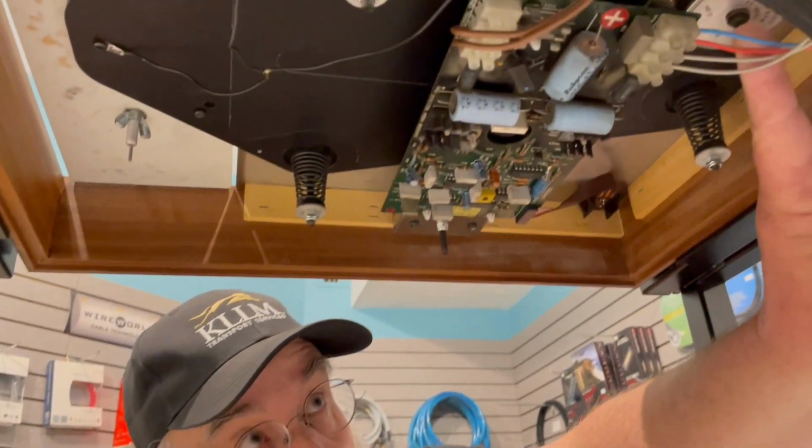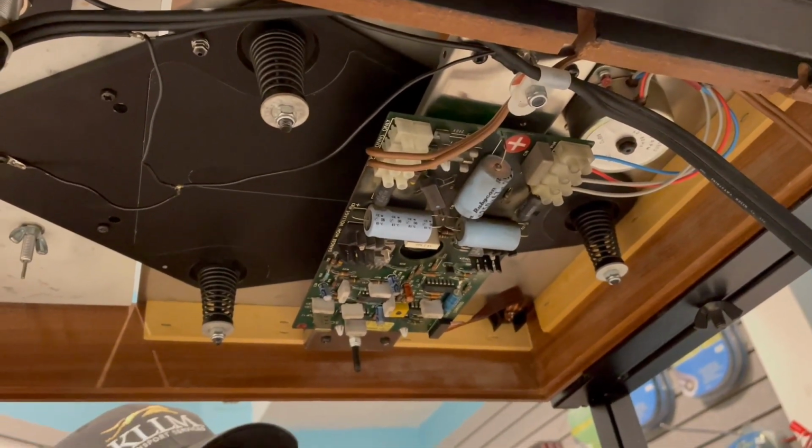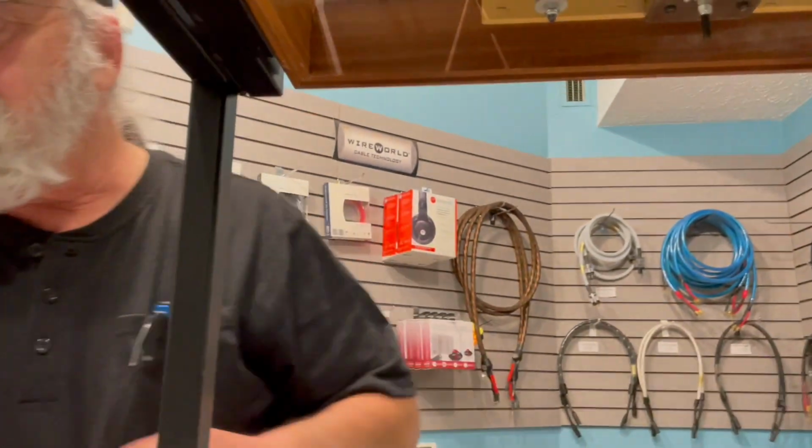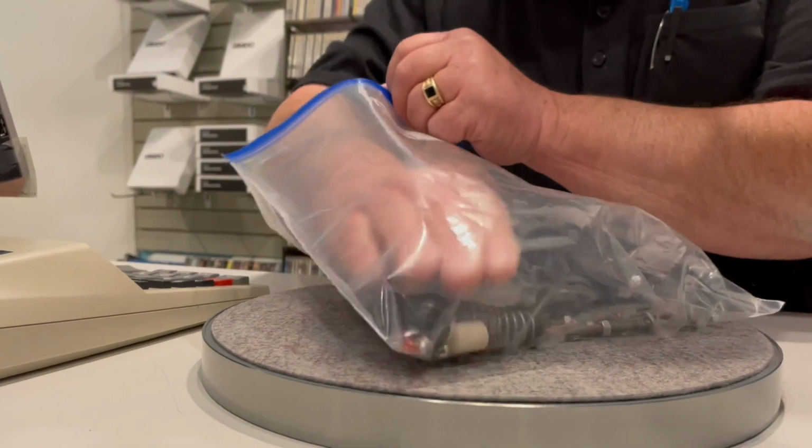Now, after all of these hours that I put into this turntable, and it's for a really lovely gentleman, the first thing we ran into was that the older motor made the typical older Linn washing machine sound. What they used to use was a bearing cap that had a plastic bearing and a spring in it, and it pressed against the bottom side of the motor. Well, the washing machine sound was essentially the spring running around in that bucket, and I've got one here. So it was adding just a lot of noise to what's going on.